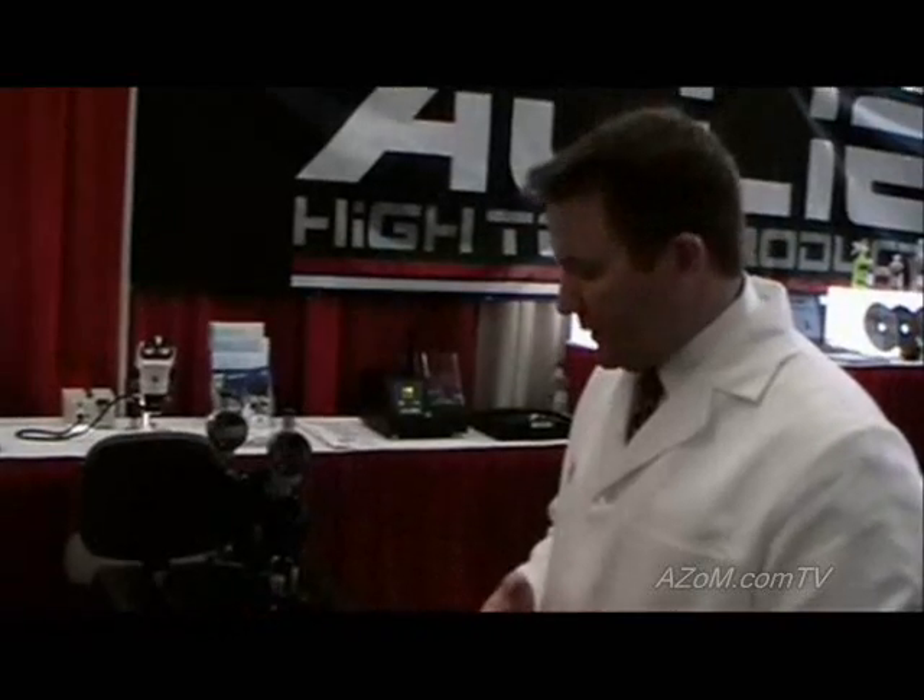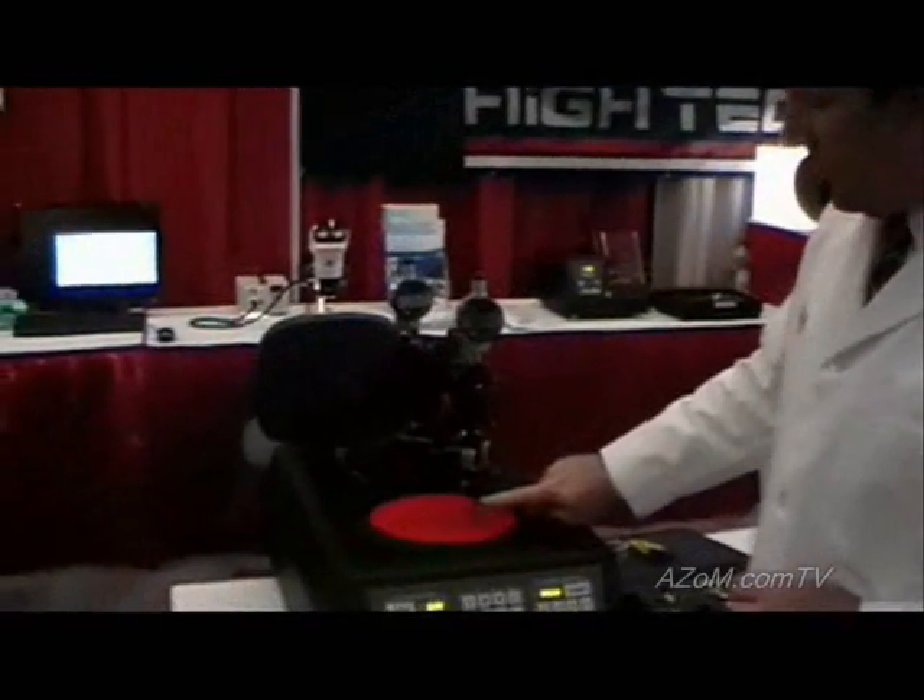It's all captive within the system. The cam lock assures repositioning of the sample very accurately, so that as the sample is removed for observation, you can place it right back into its previous location without losing its geometric orientation with the grinding plane. The fixture is loaded onto the cam lock instrument.